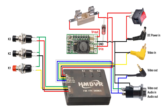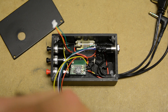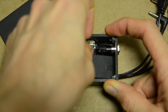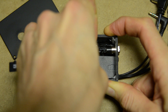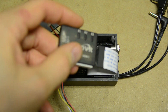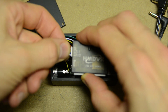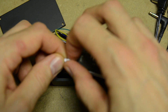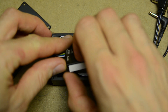Hit pause and grab a screenshot of the schematics if you need it. Let's assemble this thing. Here's everything soldered and screwed in place. Push the micro SD adapter into the slot in the housing wall — it's a nice tight fit so there's no need for any glue. Gently bend the adapter cable and push it into the card slot in the DVR. Attach the main cables to the DVR, and the cables for the 3 menu buttons.